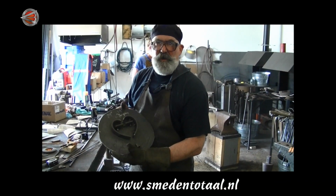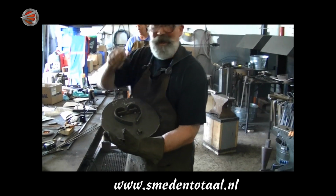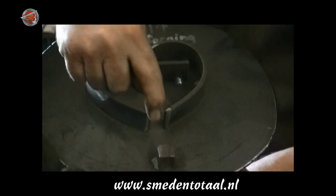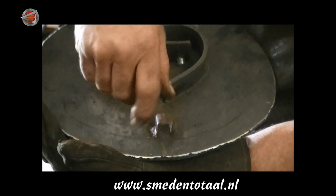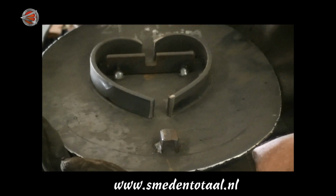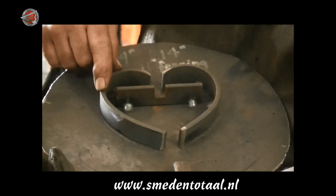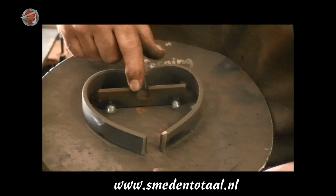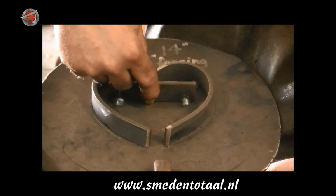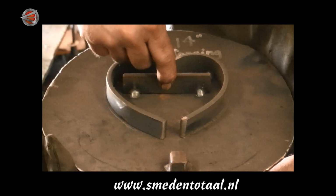This is a jig that you would produce in your shop using principally flat bar and an angle grinder. I cut a 3/4 inch tube, cut the back off it, and welded it on to stop and hold the legs on the short piece. I form these up just using a slot in the bench like you're making a scroll. I take a piece of flat bar and cut a notch in it, and that becomes the stop for the top of the knot. So we're going to push the knot up to the stop.